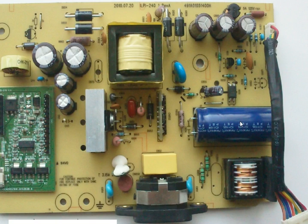Let's have a quick look at the different sections. The purpose of this switching power supply is to take AC 240V from the mains and convert it to smaller DC voltages — so we'll have a 12V, a 5V standby, a 3.3V, maybe a 1.2V coming out and feeding the main board, video board, whatever you want to call it. This section over here is used to power the CCFL bulbs that are in the backlighting on the screen.